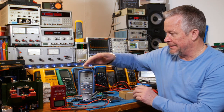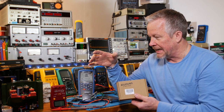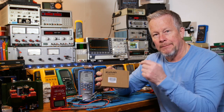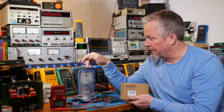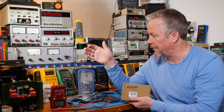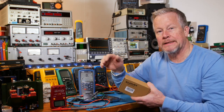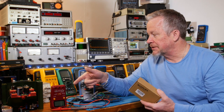These guys both range right around 30 bucks or less. This one is a less expensive version, and on the specifications they sound very similar, so I'm thinking it might be the same electronic design in different packaging. This comes under different names — I'll list some in the description below with links. One advantage the CEM has that these don't is you can change the test frequency for capacitance, since capacitance and inductance changes over frequency, and also ESR.